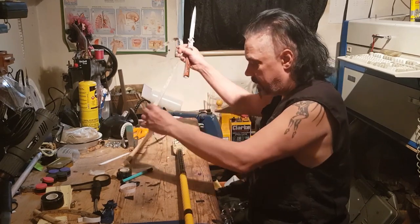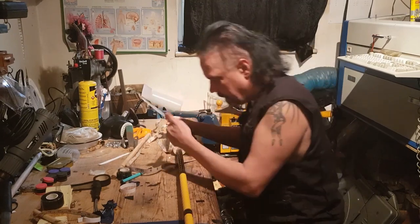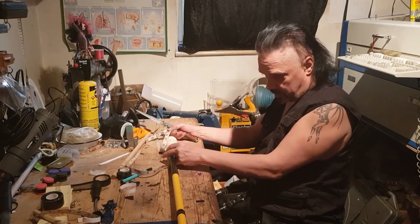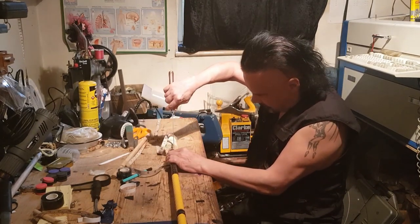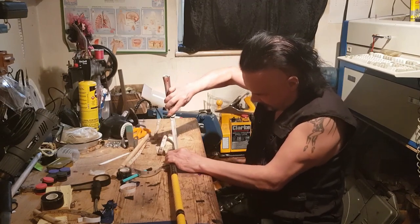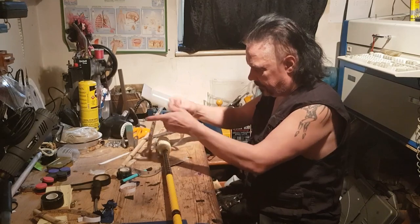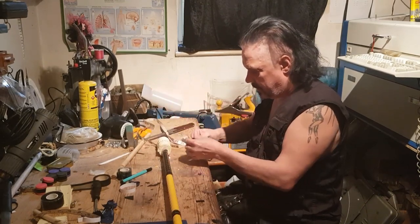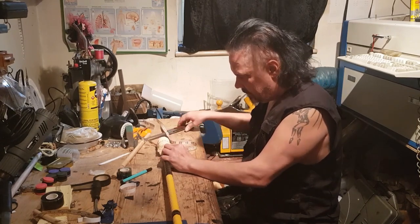This isn't just for aesthetics. Having a straight cut across this means that the silicone is only touching silicone and not touching metal, because it's not going to stick to the metal. So here I have had a problem because I just stuck the silicone to the silicone. Right here. So cutting that edge straight makes sure that everything is correct.